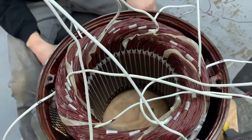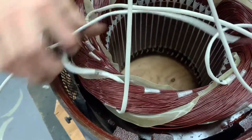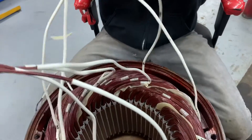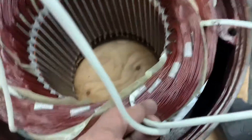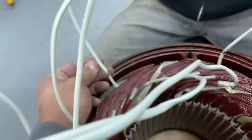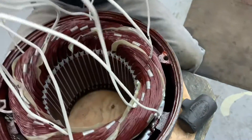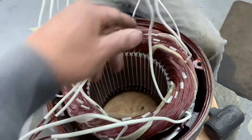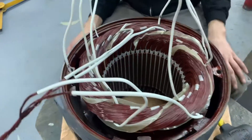So you have two delta. One-six and one-six gives you two delta. Then two and four — two and four — that's one delta, two delta. So one, six, two, four, and then three, three, five — three and five — so one delta, two delta. You've got three leads, two delta. Four spaghettis in one lead, you got one delta, two delta — two delta connection, three leads outside. Got it? Yeah, that sounds easy. It's high speed.